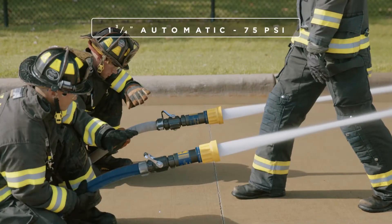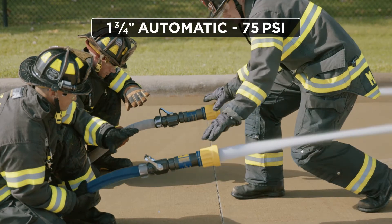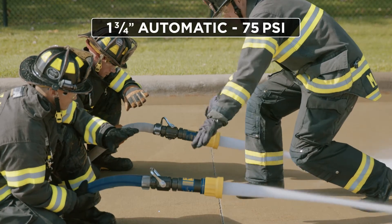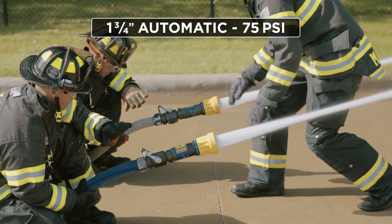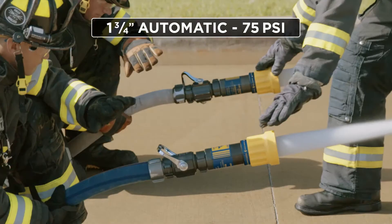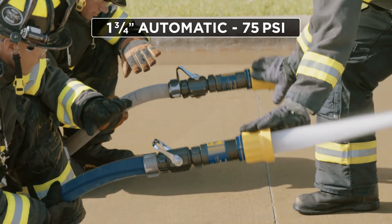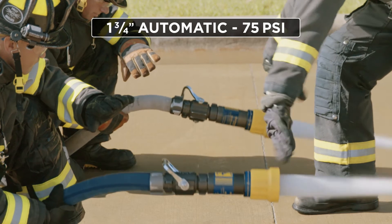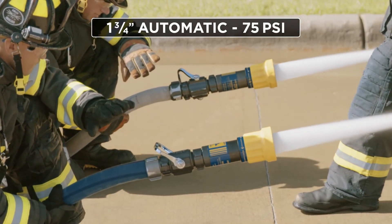In this side by side comparison you can see we again have two nozzles that are exactly the same. In this case we're using a low pressure 75 psi high flow automatic — a much heavier nozzle tip. The question is whether the nozzle or hose whip condition is created by the weight of the nozzle, or as in some cases you have to evaluate, is it due to a variation in either the construction, performance, or inside diameter of the hose being used.